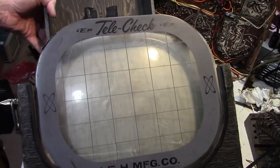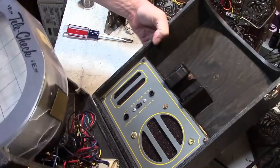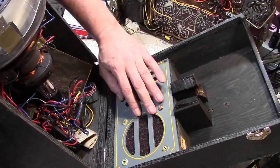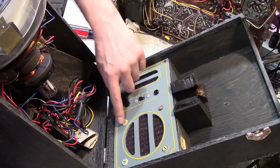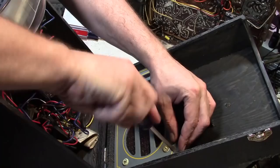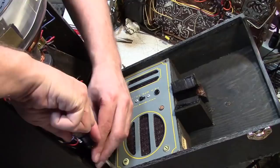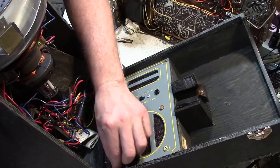Now I'm turning my attention to the Telecheck CRT Substitutor. I picked up two of these. One of them is in rough shape and I think has a damaged yoke because some of the leads were clipped out. But it has a built-in speaker and my nicer one that I've been using in previous videos does not. So I'm going to swap the speaker out to the other unit, and maybe clean up some of this corrosion in the process. I haven't looked inside of this before, but I can see it has a switch for direct versus transformer, so I suspect it's got a permanent magnet speaker or maybe two separate ones.